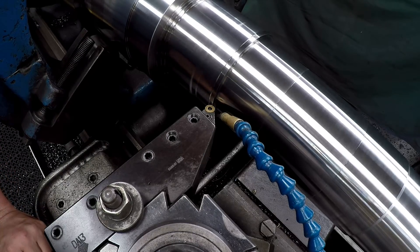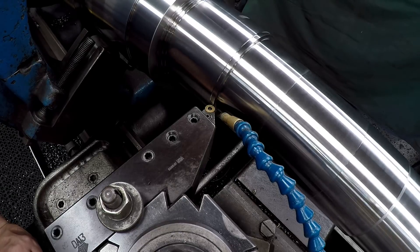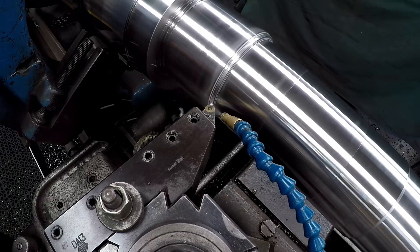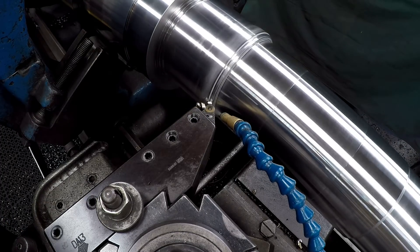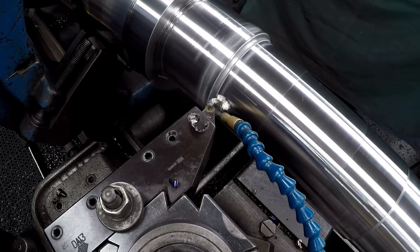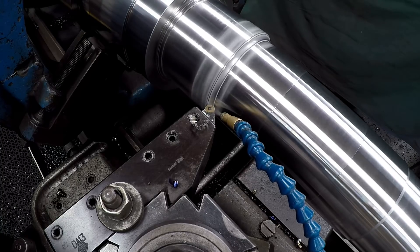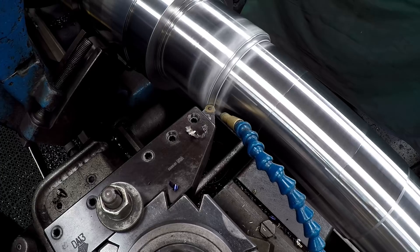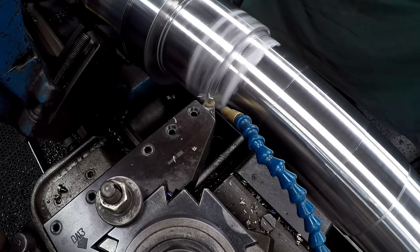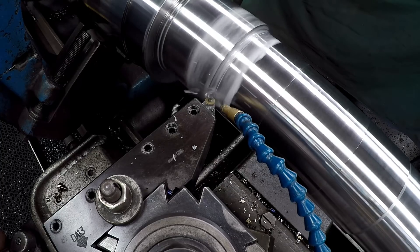That would be a quarter inch radius using the half inch round tool there. I've already got my shoulder lengths faced in where they need to be - maybe about 5 thousandths you can use to clean them up. It's already trying to chatter a little bit. I'm snugging up the top steady rest arm. Let me slow her down. What I'm doing is working both sides of it, trying to get most of it cut away. Then I'll slow the RPMs down to try to finish that out.